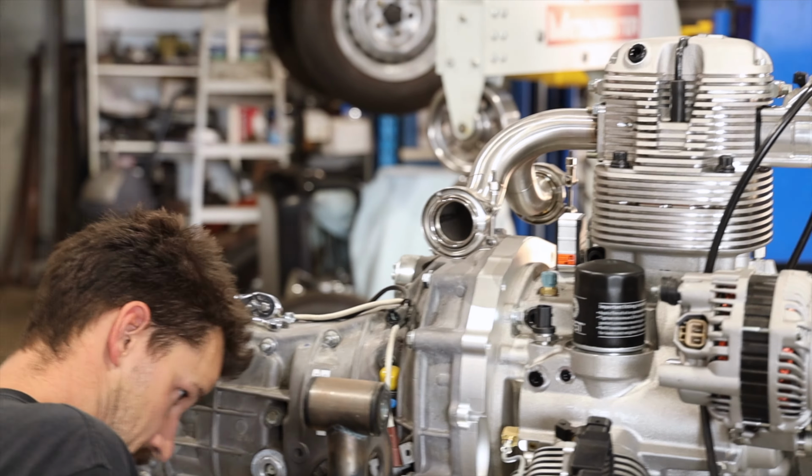Really pleased with how it's come out. I think it's going to be really neat. In that video, a lot of you have mentioned mufflers and heat, so we will cover those as well. I think I will make a provision for the bottom, with a little threaded bung that will house a few baffles that slide into the tailpipe, to take the sting out of it if it is too loud. This will also be getting completely ceramic coated. For areas quite close to the head, we will have either heat shields or run some exhaust tape, or not exhaust tape, but the fiber.